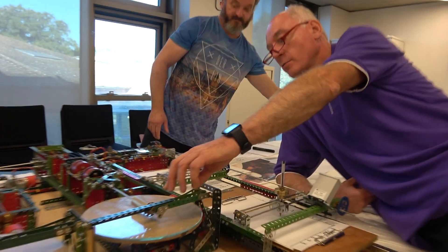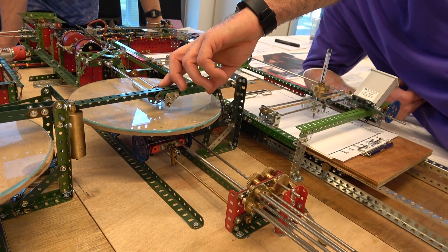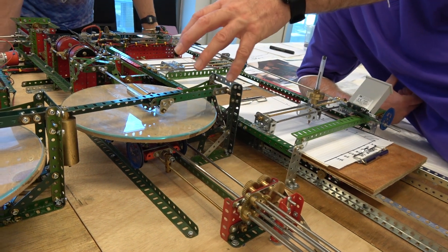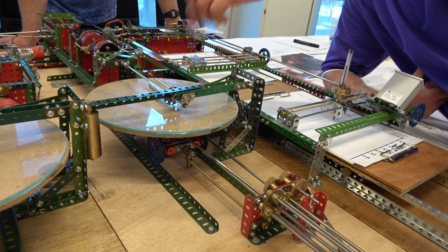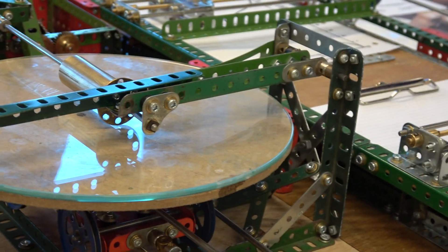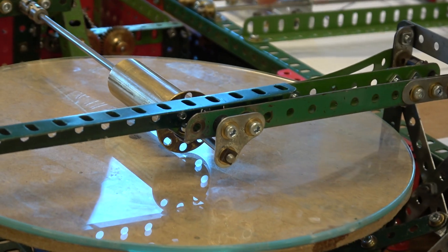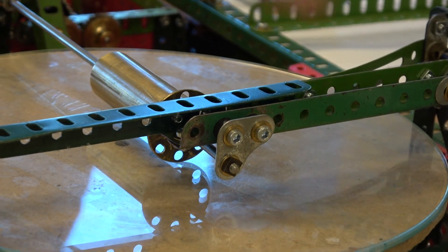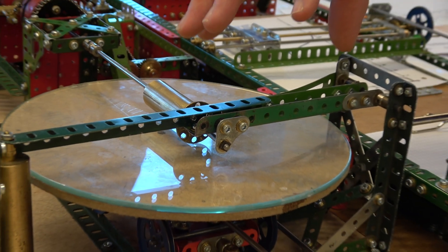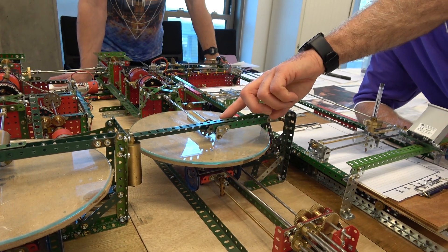So you were getting little particles of brass scraped off the inside and outside surfaces of the wheel. The fact the thing was moving up and down was dragging it across what became a relatively abrasive surface - like sandpaper. Sand is made from glass, or glass is made from sand, so you've got a perfect abrasive building up here to start wearing away the wheel. In the short term that's adding powder and will reduce friction by causing more slippage, but it's got a long-term problem because you're changing the diameter as well.